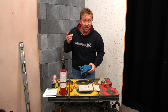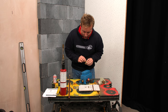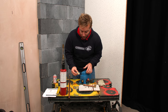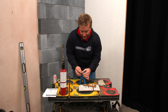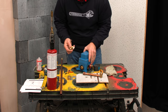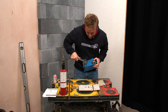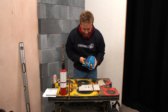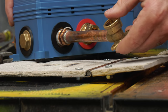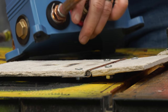For the outlet going up to the pan head, I just want to show you there are so many different ways we can do this. We've got our solder fitting just getting cooled off here. But also we've got a standard half-inch to 15mm compression elbow, so we're just going to pop that on this side here. I've just Loctited that up as well, and we're just going to get that pointing up like that. Now I can pop this in here and just twist this so it's facing the right way. We're making this job super breezy.